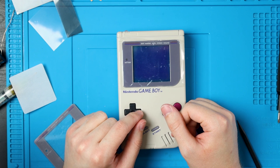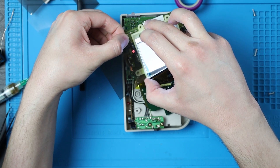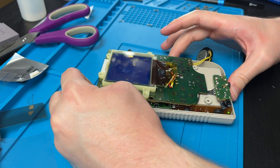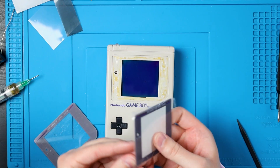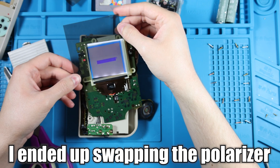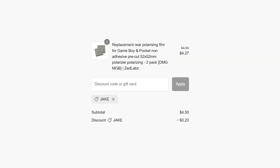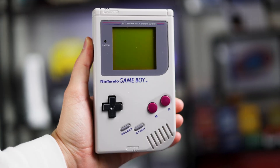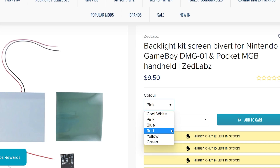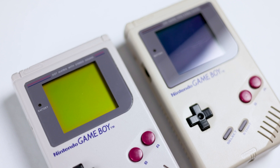After I've spent a while with it, I'm going to give you a review and it'll look a lot nicer than this. I really wish that the polarization film that's included wasn't sticky — the adhesive isn't really necessary here. And with how little room you have to work with, bubbles are bound to happen. Mine has bubbles and I used to install a ton of screen protectors when I worked at AT&T. With how dark the polarizer is and how bright the backlight is, it's not too noticeable, but it's something that my brain will always be looking for. Zed Labs at the very least does sell the polarizers without the adhesive back, but unfortunately it's sold separately. One other little thing about the polarizer is I wish it was green — I know that people famously made fun of the DMG's pea-green screen, but I was hoping to keep mine looking as close to the original as possible. You can buy a ton of different colors for the backlight, but I was also hoping it would look green while off too.